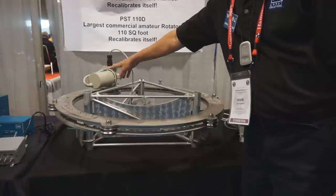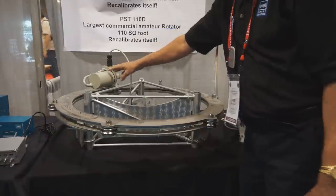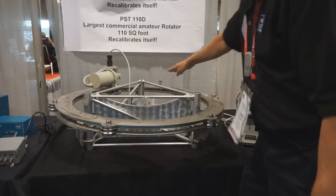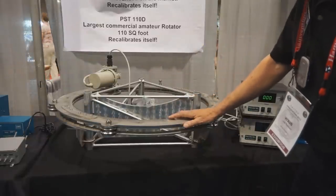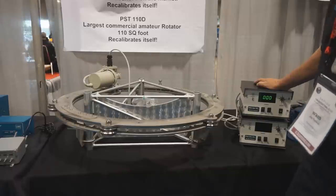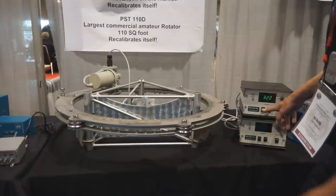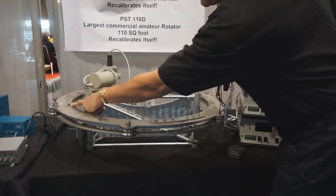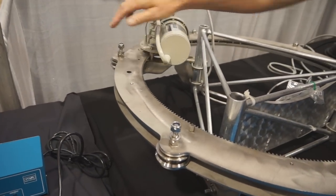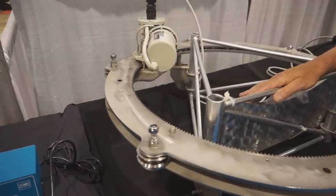The hall effect device is optically isolated, so if you have a lightning event or nearby lightning strikes, you're not going to blow up a potentiometer, which is commonly used as a bearing indicator in most rotators. The plate that mounts to your boom is secured to the tower and mounts on two rings to turn your antenna around the tower. The controller is unique in that this rotator self-calibrates. If I turn it manually counter-clockwise, you'll see there's a magnet mounted on this post that comes into view. That magnet passes through a detector underneath the motor, right here. Every time that magnet passes through, the controller knows what direction you're pointing because you've programmed that into the controller with software.